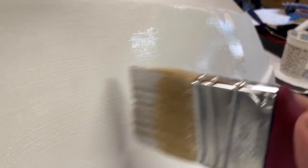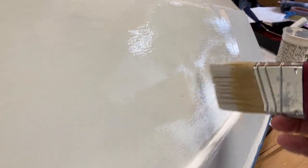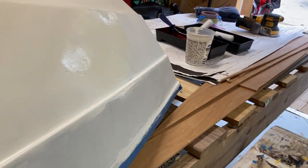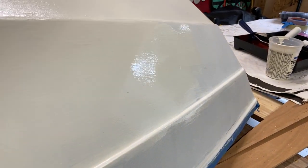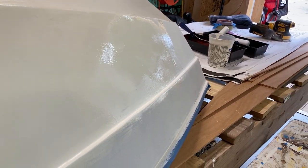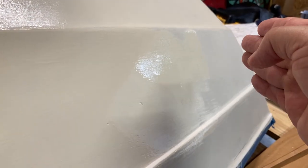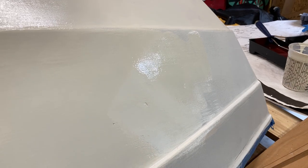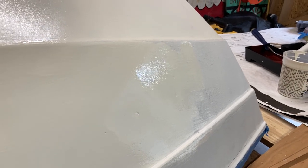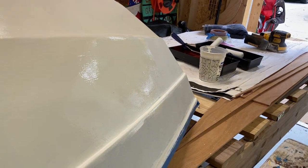So different paints, different days. Sometimes there's more of that texture sticking up that I talk about. So we're starting out here on the dry edge, going over the wet edge. Once you've gone over it about twice or so, then you've done enough. You've done your duty. Time to move on to the next bit. But you want to keep this edge down here wet, because if it gets hard, you'll see a lump under there on your next coat of paint. And just keep moving, keep the paint flowing well. Balance the paint with your conditioner to get what you want.